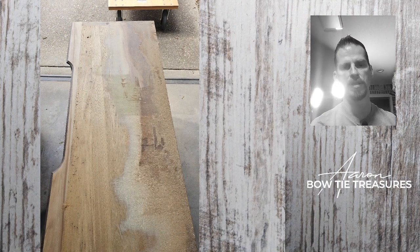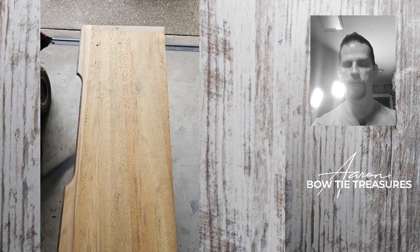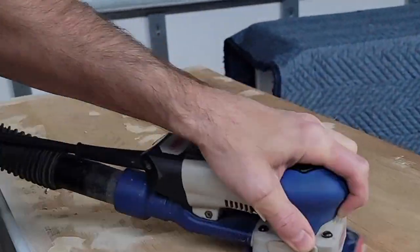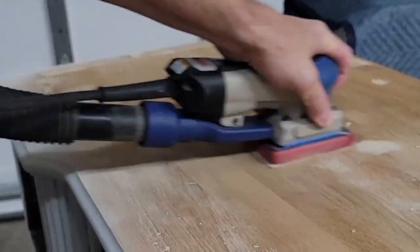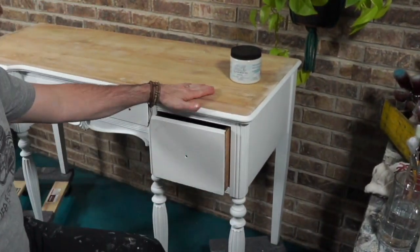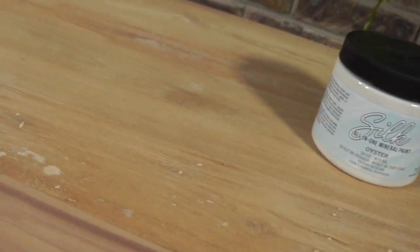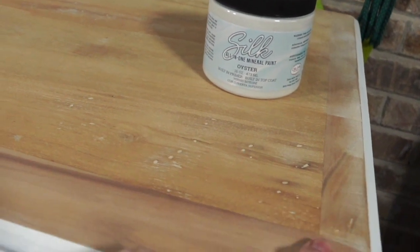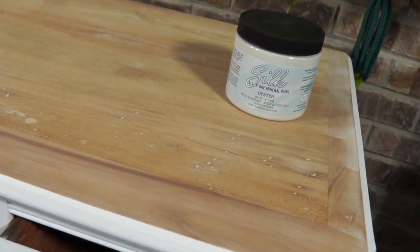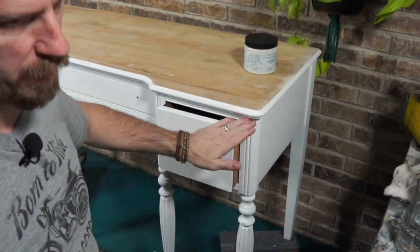What I have left now is really the base cabinet construction wood. Since that picture, I patched all the main holes with wood filler and gave it a nice sanding with 220 grit, so it's really smooth. I'm actually going to own the way the wood is — I'm not trying to refurbish this to its original condition. I'd like to let some of those holes and imperfections show. We're at the stage now where this piece is ready for stain or whatever I want. I'm kind of liking the wood, and I can see the patchwork and the different wood grain. I think it's kind of cool, so I'm going to leave it. If I don't like it, I can still paint over it, but it can't hurt to try some stain.